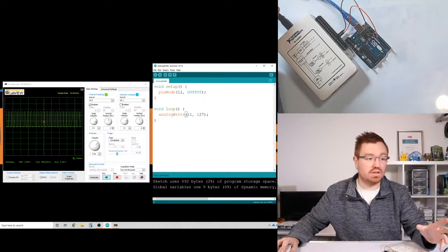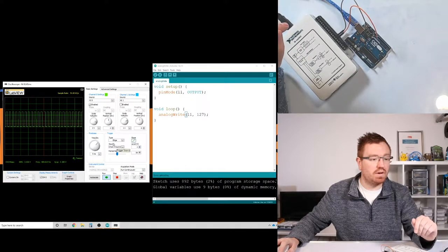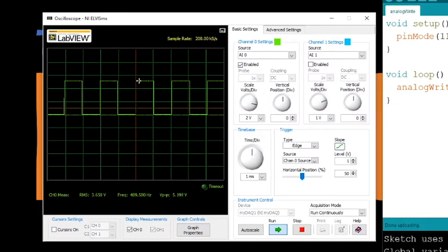It's wiggly - and here we go. Now that is actually showing pulses. Let me put a trigger on here and set my trigger level to 1 volt. Let me slow it down a little bit - let's go one millisecond. So what that's showing me is it's actually going between 0 volts and 5 volts and back off again.